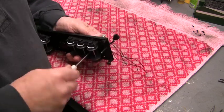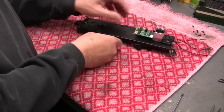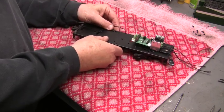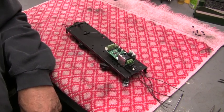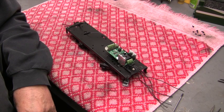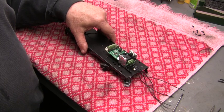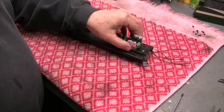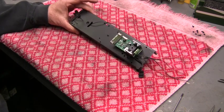Put the screw in at about the center, turn it over, screw it in, and make sure wires are out of the way. You want the board fairly straight on the chassis — and just like that, you've got your board in and you're ready to start hooking up wires. If your tender frame doesn't have holes where you need them, just drill a hole in the bottom using a sharp drill bit, placing it somewhere central where the board won't interfere with trucks or couplers.